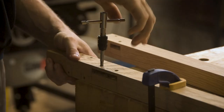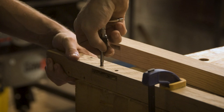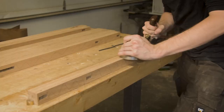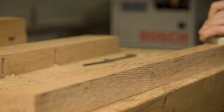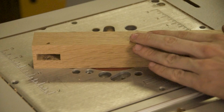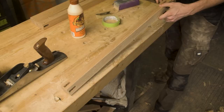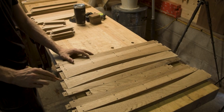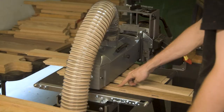One of the other big important things with this project is I wanted this desk to be easy to move. So the back panel that you're seeing me do here is held in with a couple of threaded bolts. Now these bolts are threaded directly into the wood and make it so that with just a simple Allen key, I can remove those bolts and disassemble basically this entire desk. So it's super easy to move, it's all in its own individual components, and so someday if I have to move across the country, it will be very easy to just pack up this desk and bring it along with me. Unlike a lot of the other furniture I build that is very big and very solid, this desk is supposed to be easy to move.